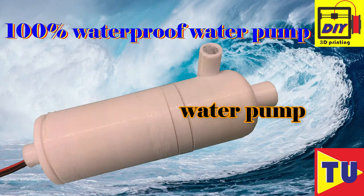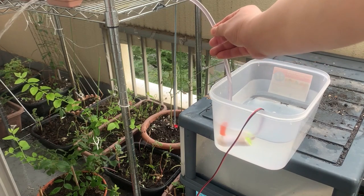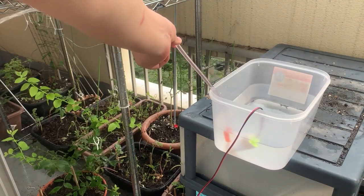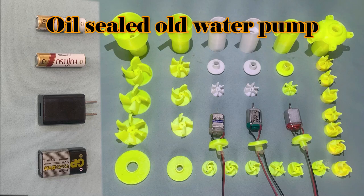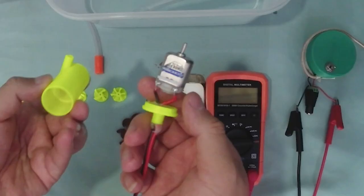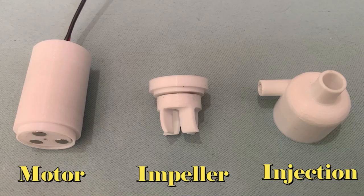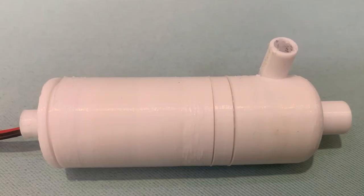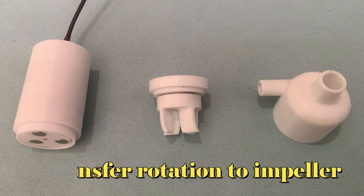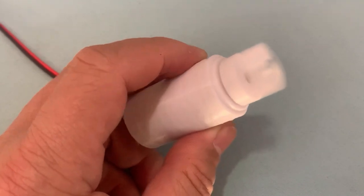Number 2: How to make a 100% waterproof water pump. Water pumps and submersible water pumps always have the issue of water leakage, especially in homemade DC motor setups. I also designed a waterproof pump using the oil seal method, but after long-term use, water leakage can still be a problem. Using magnetic force to transfer motor torque to a rotating impeller is a new idea and concept that I have not seen others use. Since the rotation chamber and the motor chamber are separated, it is completely 100% waterproof if all parts are sealed well. Magnetic force is very interesting and really good for making new things with new ideas and concepts.